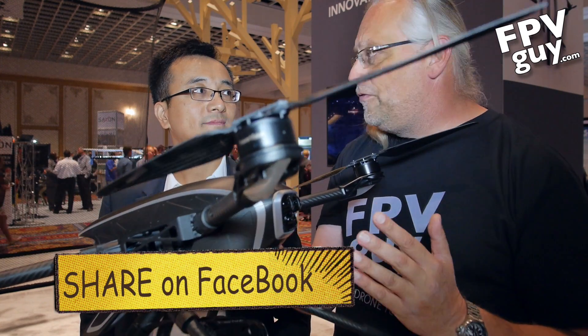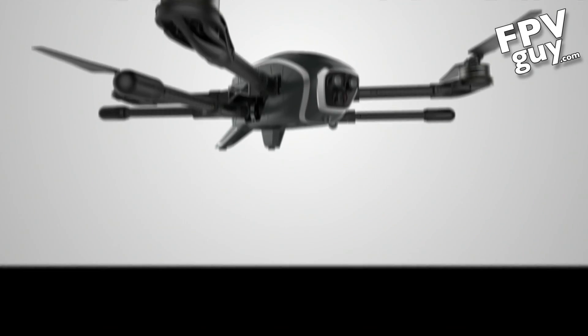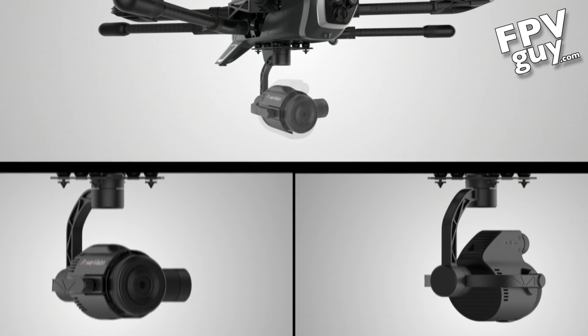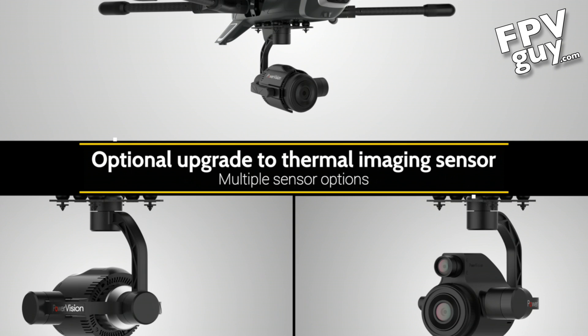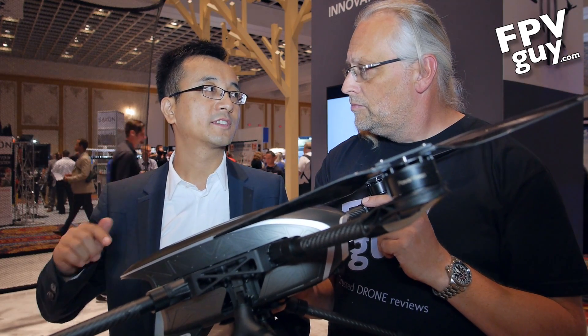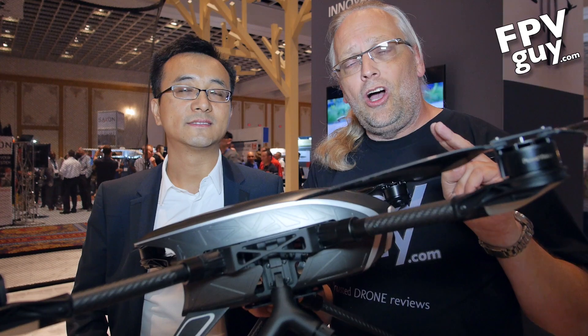So this has a Micro Four Thirds camera, and you have one other camera option for it also? Yes, we have a thermal camera on top of it, which you can choose for the payload. So when you are flying with the EO and thermal together, you can switch on your ground station between the visible light camera and the IR camera. For search and rescue, and for people out there inspecting solar plants and looking for bad panels — you need thermal cameras, and this one is now available with a thermal option, so you can use the visible light camera and with one button switch to your thermal camera.